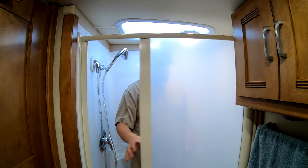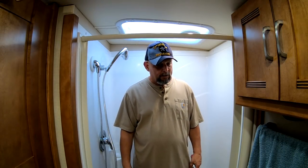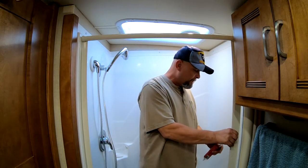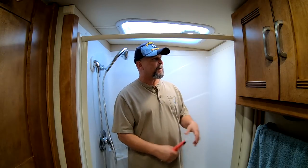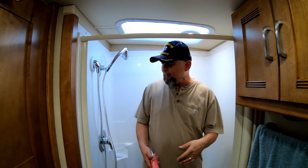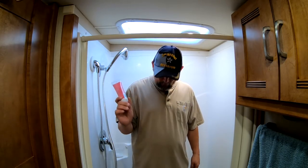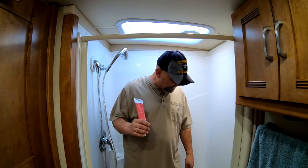The door is that poly — antimicrobial material that won't grow fungus. It's really light. And every time it rolls back up into its canister, there's a squeegee mechanism on the inside that squeegees the water off back into the shower. The last step of installation is to use a kitchen and bath adhesive caulk — I'm using clear — going around all the outside edges and probably the inside edges too, just to seal it up real good.